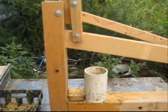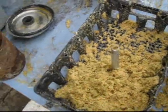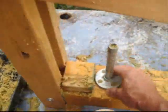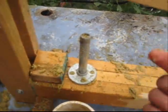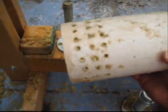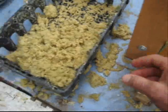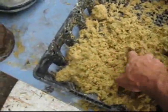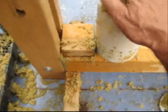Here I've got the press set up. What we have is this piece — it's just a flange with a half-inch piece of pipe on it. That'll make the hole up through the center of the briquette. Then we have our mold, which is just a piece of four-inch PVC pipe with some drainage holes drilled into the side. We set that onto the press and then get handfuls of this wet mash — the pulverized hay and sawdust — and put it down into the mold.